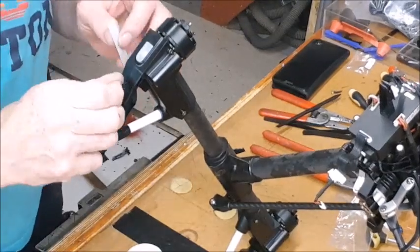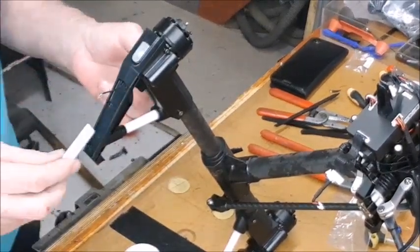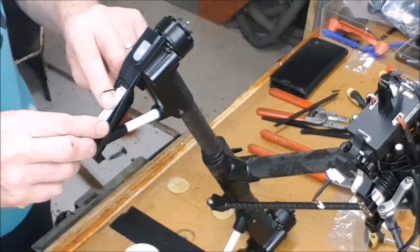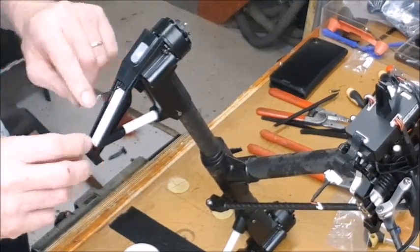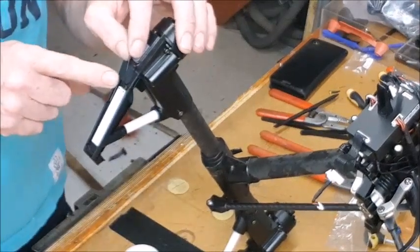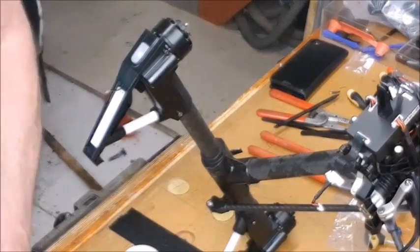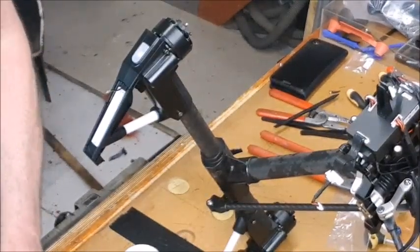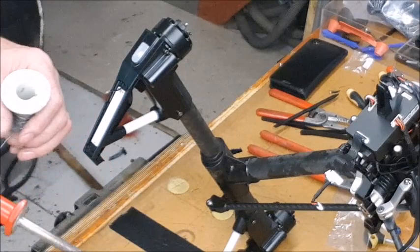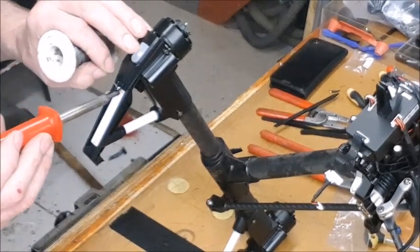Okay, now for the very important part of putting the aerial on. Now obviously without this, no communication with the drone at all. Place on the front there. Simple. Connections are at the top. You'll see on this one it's nice and new, so they're untinned. They're just in copper colour. So the first thing I want to do is tin them, two points. It makes it quicker and easier for soldering. Very gently.